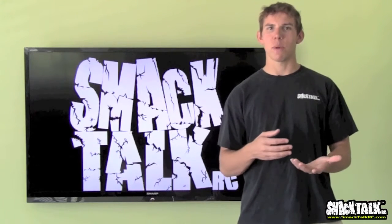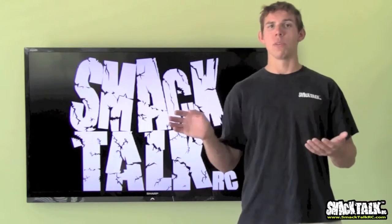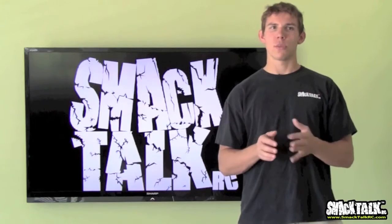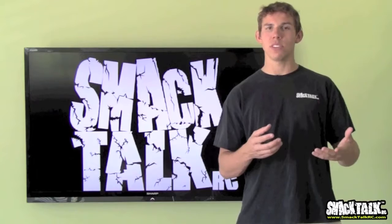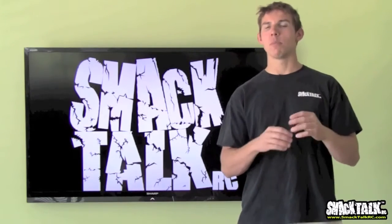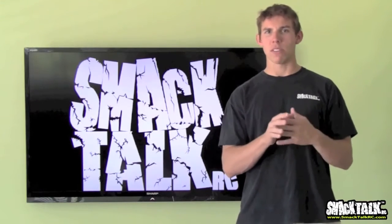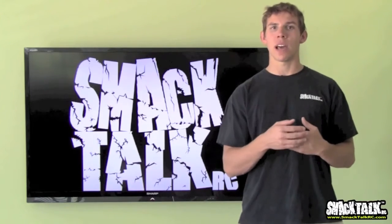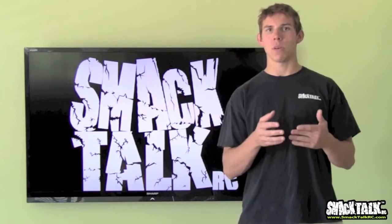If you look at most of these batteries, even the cheapies, they're holding 3.94 volts per cell for most of the flight time until it dies at the end. So when it tells you that 95%, it's holding back so much power, it's kind of getting inefficient. So you can turn that number up to 105, 110% on the governor mode, and it's maybe not quite 110, a little above 100, and it's totally fine. It'll give you a red error, but that's kind of where Bert and I would run them, and they seem to work better, and it would get you your head speed where you want it to be.